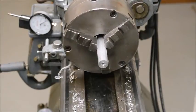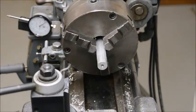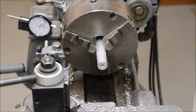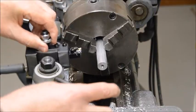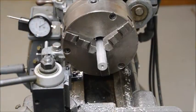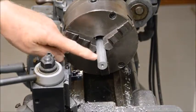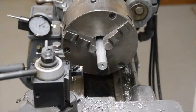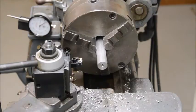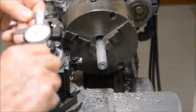And the other thing we want to do is the bolt. This shaft is 3/4 of an inch in diameter, which is pretty handy for holding on to. You can get a good grip on it when you're trying to clean the bolt up in the wire wheel. But you'd like to be able to get up a little closer to it with the wheel here, so it'd be nice if this diameter was smaller. So we're going to go back about 3/4 of an inch. Don't need this kind of precision, but this is the instrument I've got handy.